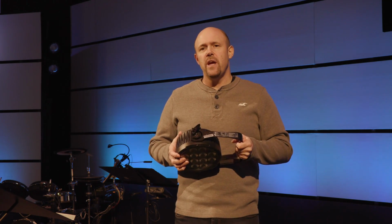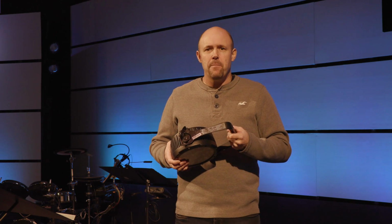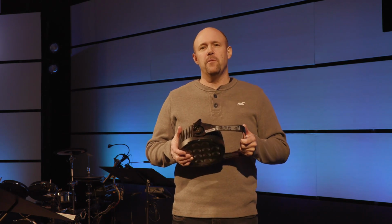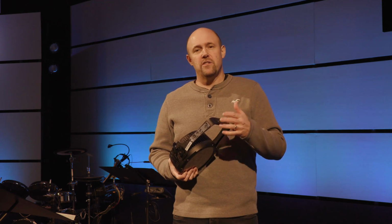For here in the United States, the breakers and circuits that we have are between 15 and 20 amps per circuit. And that's just typical for church buildings. What you do to get the number of watts is you multiply the number of volts times the number of amps. So if you go to your panel and look at your circuit for the outlets that you're going to plug these into, you can see, hey, outlets are usually on 20 amp circuits in commercial buildings. You can multiply that by 120, or I oftentimes will just round down for a little bit of safety to 100. And so 20 times 100 is 2,000. So 2,000 watts is what that can support.